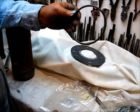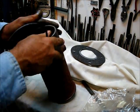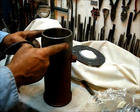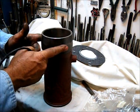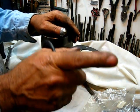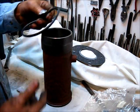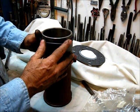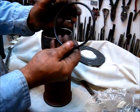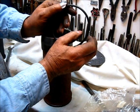O-rings. These are standard off-the-shelf O-rings. If you own one of these engines, you will know what size to buy. All you do is put the micrometer on the outside of this right here — the caliper, whatever — measure the outside. Then you measure in the block, the bigger diameter of that hole. This is just off the shelf down at the parts store. The way you know if you've got the right ones is if it goes on here and it's tight. When you put this in the block, the hole in the block is smaller than the outer diameter of this, so you're compressing it on the outside and on the inside both.